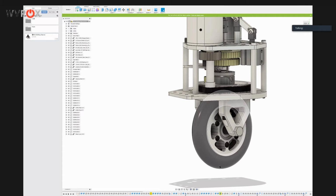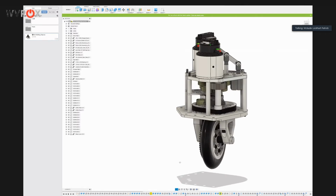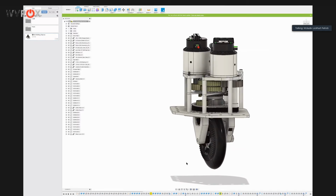There's a few others. One is, I think the pneumatic wheels generally have better traction, and they can give the whole swerve drive frame a little bit of movement, so that if any of the modules are slightly off or not mounted perfectly, it has a bit of play so that we make sure all 4 wheels are always in contact with the ground. That way our steering doesn't go whack or anything. So just overall consistency in steering and that kind of stuff.